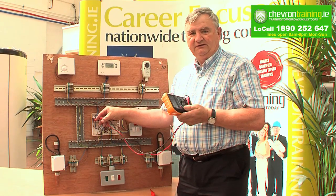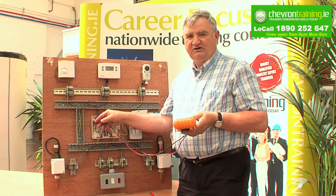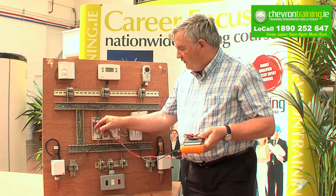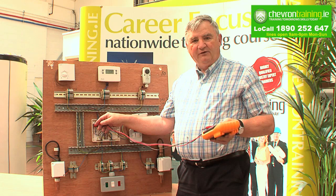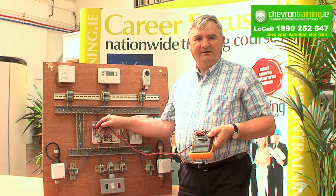You do not trust an electrician or anyone before you — you must check the board to see if the power is in the correct terminals. In this case we could have the power switched between the live and the neutral, so therefore we will check the polarity before we start checking on any other aspect of the board.